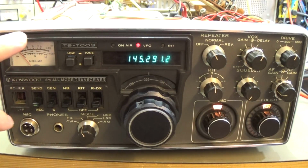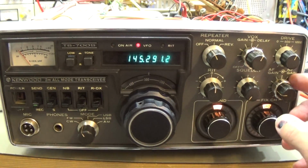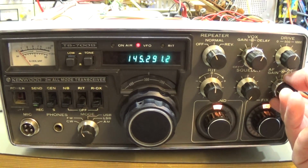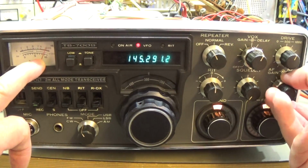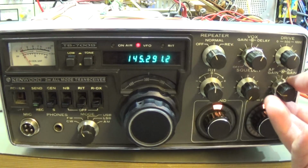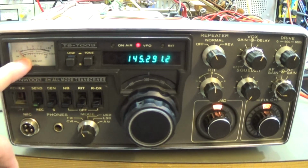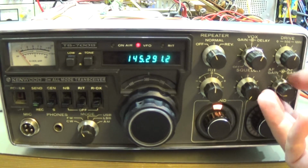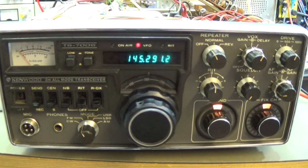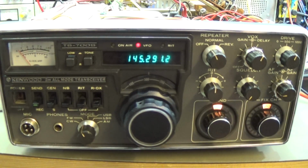said, we are feeding in an S9 level, so you see nothing here, but we have our RF gain potentiometer, and when we turn it, we see that the S-meter is moving. That is then finally telling us that the meter itself is working, and we know that the needle is not sticking due to a mechanical problem or whatnot. So that is always a very good first test, and we know that it is working. I mean, what we are doing here is basically very simple.